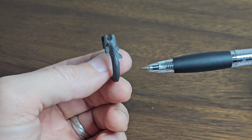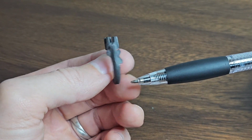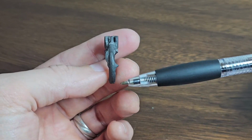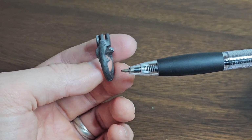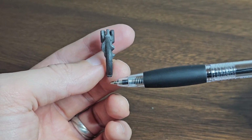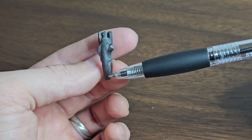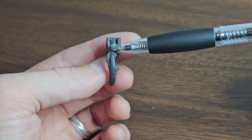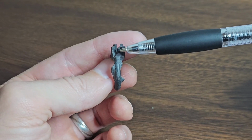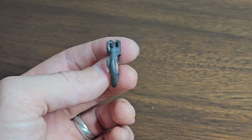One thing I should probably point out is that I don't think I am aggressive enough in making these models look like the final product. I get worried that the metal's not going to flow all the way through and the models are all kind of big and clunky. I do think that making something that's about 3 millimeters wide where the metal first comes in is a good idea, but as it gets closer to the other side, you can probably start tapering down more towards 2 millimeters, and in the prongs themselves, 1 millimeter thick will usually cast just fine.